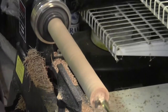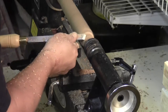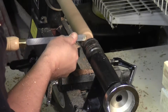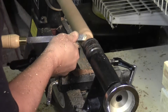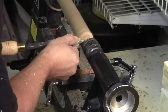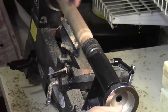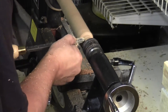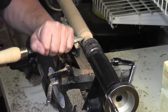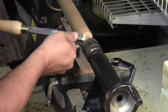The bar is half inch and I'm using a half inch bit here. In my experience making handles, the trickiest part seems to be making the recess for the ferrule. The mistake I keep making is I think I'm sneaking up on it and I end up over-cutting it so the ferrule ends up loose. So I was really careful when I made this one to sneak up on it. What I'm doing is — there's a slight taper, and once I get the ferrule to go on there, I put it on and twist it, and that burnishing mark will tell me it's the right depth. You could use calipers to measure it, but I think this is the best way I've found to get it nice and snug.